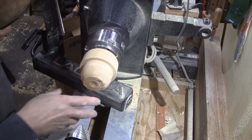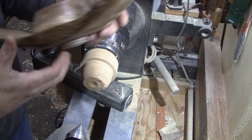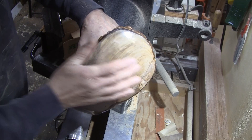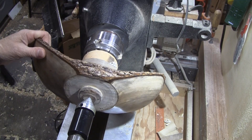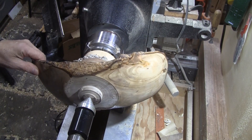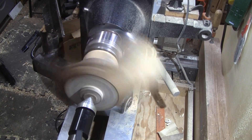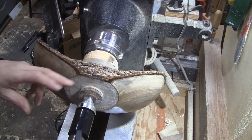I've got a block that I just turned to fit this piece in particular, but I'll be able to use it for other things. I'm going to use a piece of padded non-slip material — it's going to be somewhat of a friction fit and I'm hoping I can pull the tail stock away and do the final cutting and sanding. I'm just tightening it up and squaring it against there. It's not an extremely tight fit, but enough that it should hold it. Let's see how it turns — well, that's not bad.